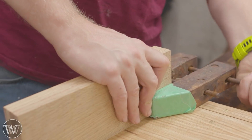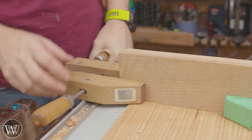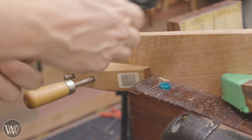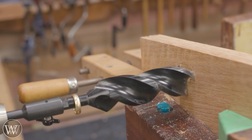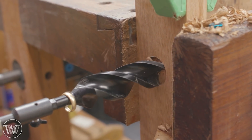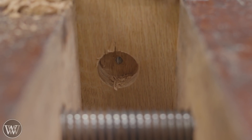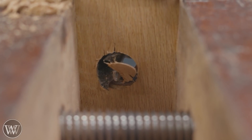Now these are going to be slightly taller than they need to be at three and a half inches - it's hard to get your fingers down in between them in the slots. So I want to create a finger indent where there's enough space so you can actually get your finger all the way down to the bottom of the tray. To do that I'm going to clamp them all up together and make a scoop out of the middle. I have an inch and a half auger bit - a Wood Owl auger bit. If you put a ring on there it allows you to know that it is level, so if you are too far up or too far down it will tell you. I had to move it in the vise so they won't split out with that heavy lead screw. I'm going to go until the lead screw just pokes out the other side, turn it around, and then come back the other way.